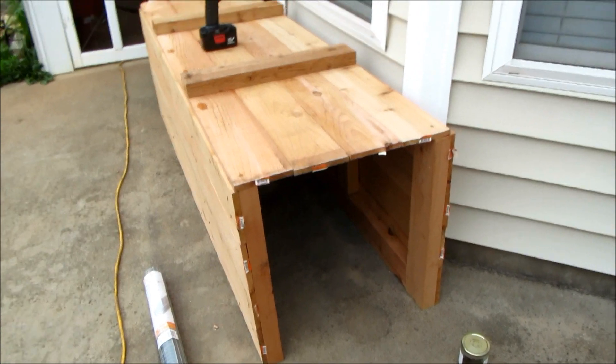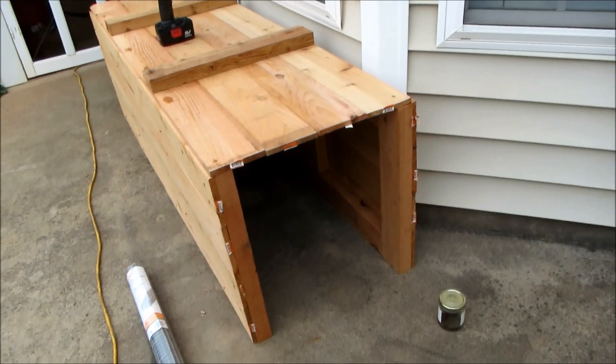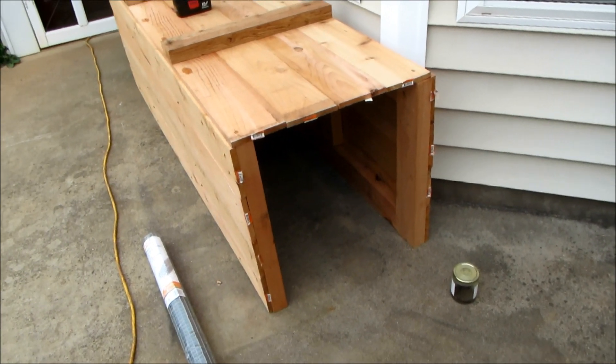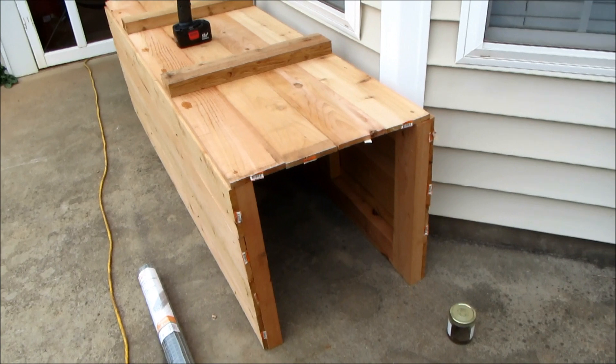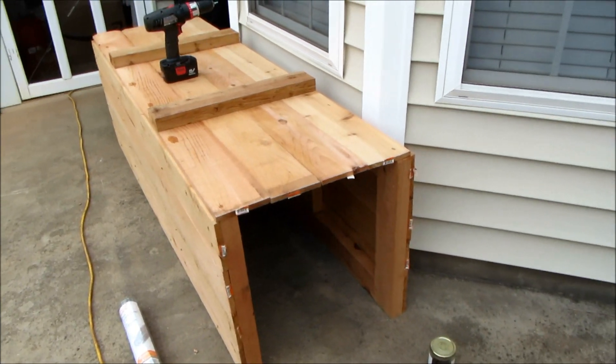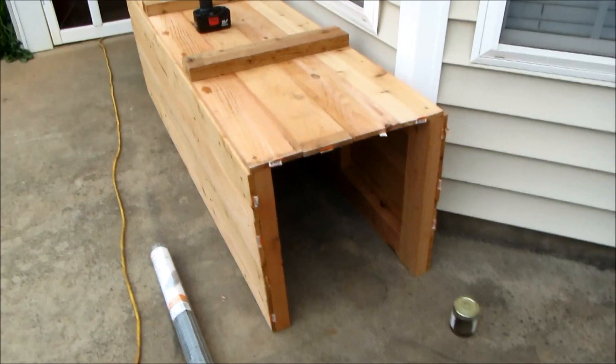To install the second wall, the best way is to actually lean the second wall up against the house and then scoot the bottom on top of it. Line it up as close as you can on one side, then make sure you come to the other side and do the other screw before you start screwing multiples in the middle, because you might not be square.